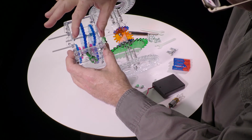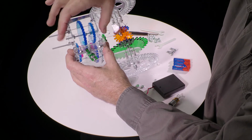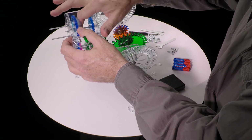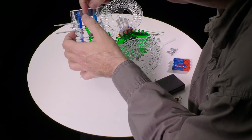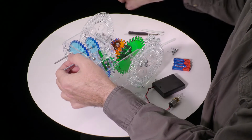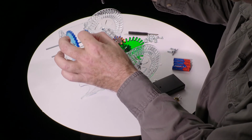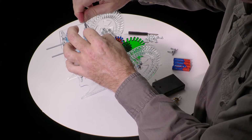And at that point, back it up by half a turn or so so that there's just a bit of wobble here. Then slide that gear over there, hold it in place, and spin that nut to be finger tight. And try to get these tightened up again. Okay, check for play, and then we can use 2 wrenches on each of the gears to get these tight.